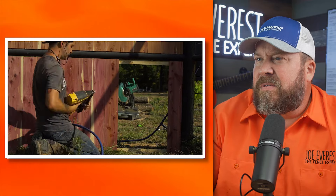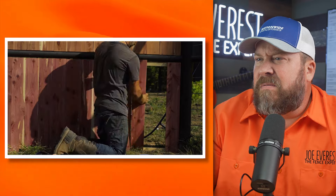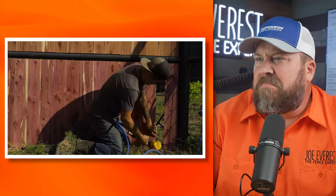It was pretty cool seeing the boards go from a purplish red color to brown as he worked — you can watch it happen. I'm guessing the project was done over a weekend; my experience is usually two or three days. This is a nice example of a fresh board shaded from UV exposure showing that purple color on the bottom, while boards with two or three days of direct exposure turn brown. The nice thing about eastern red cedar is the marbling effect — it gives a lot of character. Staining it, preferably with an oil-based stain, would really make that color pop.